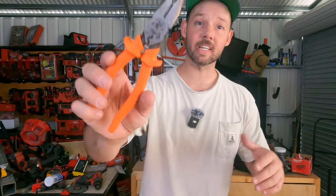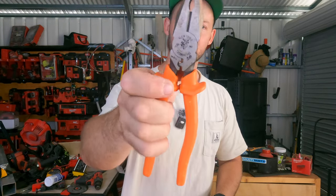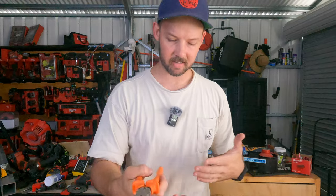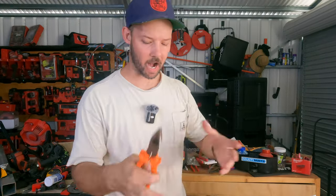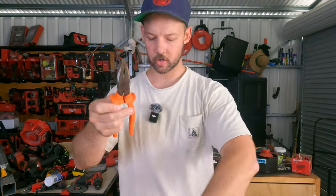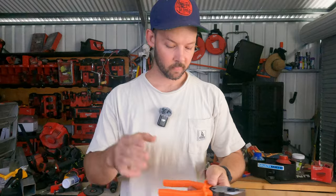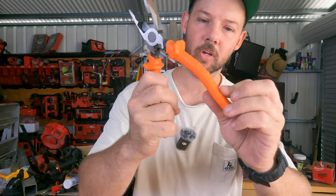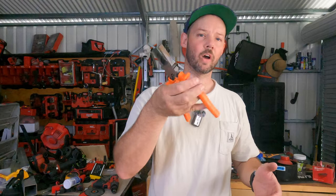The Klein Tools pinch cut, part number 12098AENS. These are Klein's pliers — 1000V rated, with nibs and a crimper. The cut is probably average to good. On 6mm it's a struggle, has a good sound, but harder than a lot of others. Definitely not as good as the NWS. They are 215mm long and weigh around 375g. Klein has changed the handle design — they've added little bumps along the grip for extra grip rather than going with the generic feel everyone else uses.